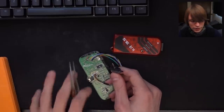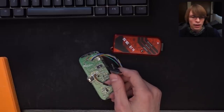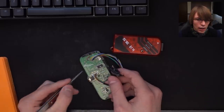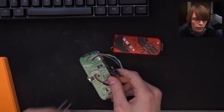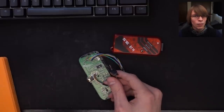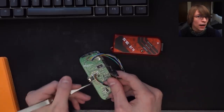We're basically turning this into a serial keyboard and we're going to be interpreting that with a Digispark clone. Like I said, all the exact pinouts are going to be down below. However, the color diagram here does not correspond to what you're looking for — red isn't positive, black isn't ground, and the orange wires are not your signal wires. So make sure you check the diagram and reference the actual pins and not the colors of the wires.